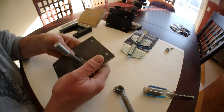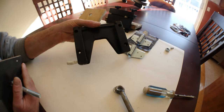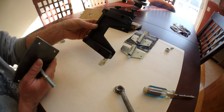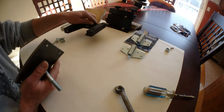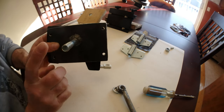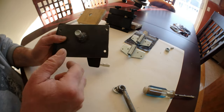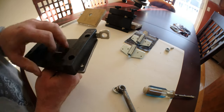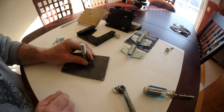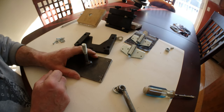What I did is measure the base of the Quick Release. This one is for a Scotty downrigger, but you can do it for any brand name downrigger — you can do the same. What I did is weld a half inch bolt to the metal plate, and drill the hole for the Quick Release bracket. I'll fast forward and assemble it with the Quick Release to show you how it's gonna work.